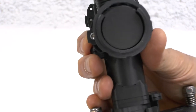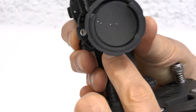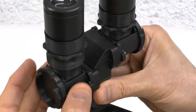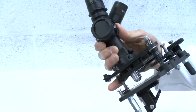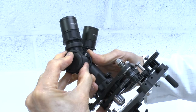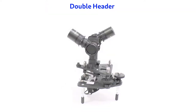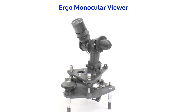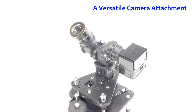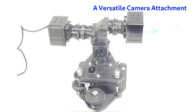The mirror block tubes fit into the outlets of the splitter block via screw and shim pressure fittings in a sliding arc slot, allowing a large degree of rotational freedom and a smaller degree of translational freedom. Unlike most microscopes, Puma's binocular head module is very versatile and can be used for four purposes: as a binocular viewer for one person; as a double-header so two people can look simultaneously; as an ergo monocular head where the viewing angle can be adjusted without tilting the scope; and as a camera attachment port for one or two cameras simultaneously.